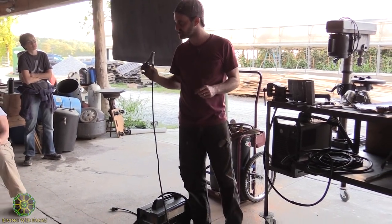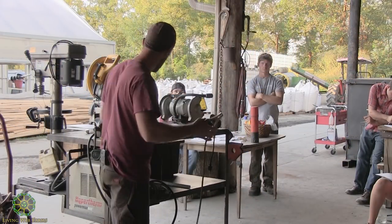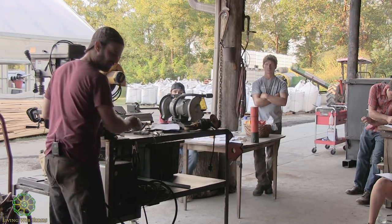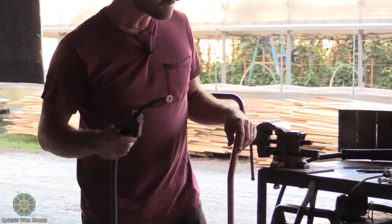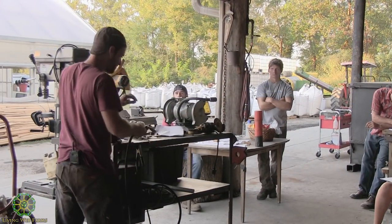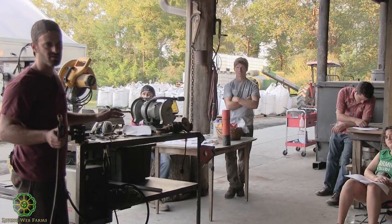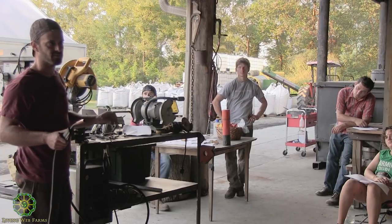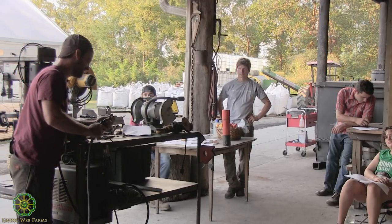Evan talked about electric arc welding. That's all we're talking about here, is making a circuit with your ground clamp. If I want to weld to this, I'm gonna ground my piece, okay? And then I'm gonna take my gun here or your stick electrode, and you're gonna hold it up and maintain a small gap from what you're welding. Like you might be 1/4 inch or 1/8 inch or 3/16 or something. That number, don't be intimidated by that. It's incredibly hard to maintain a perfect 1/4 inch the entire way. That's something you're only going to learn to do with practice. I don't do it, and I've been doing this for ages. At least it feels like ages.